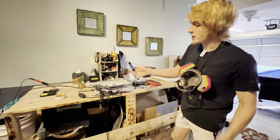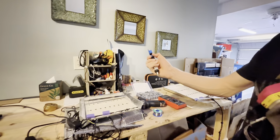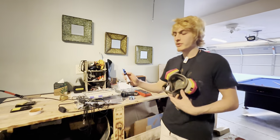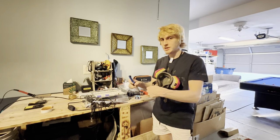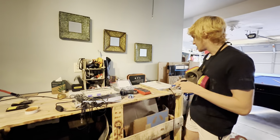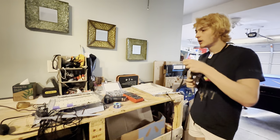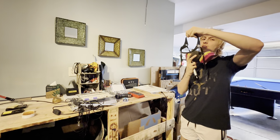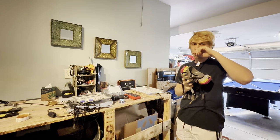Essentially, what this is, is a little air pump. You push this down and it sucks up air into it. So when the solder is really hot and liquefied, you can suck it up into it and desolder. So I'm gonna desolder these leads a little bit. Ow, it poked me. And then suck up the solder and try and show that to you guys as best as we can. Freddie, you may wanna turn the flash on.